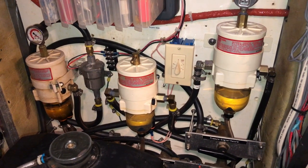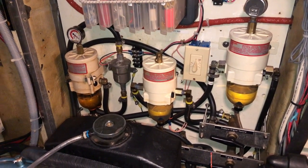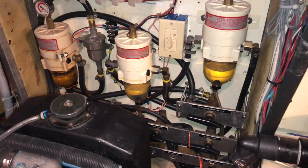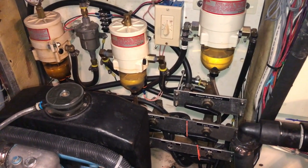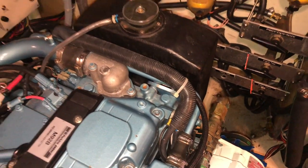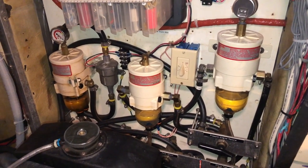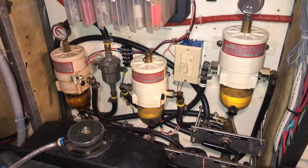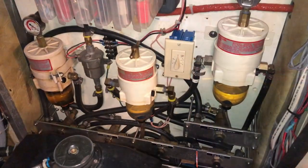Looking at the forward engine room bulkhead under the companionway — this bulkhead is actually a soft patch. The last time we repowered, it took me about a day and a half to get this out, get the front bulkhead out, and then you get perfect access to the front of the engine through the companionway. You just drop a boom truck hook down, pick up this mount here and one here, and then use a chain fall on the back of the engine from the engine room roof. And this being an aluminium boat, the engine room roof is plenty strong enough to lift the whole engine off the beds. I even carry a chain fall and a clamp for that purpose.